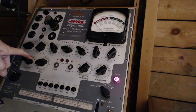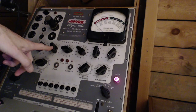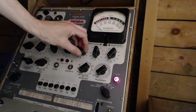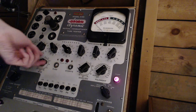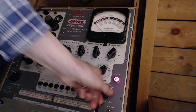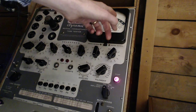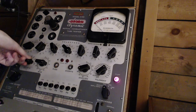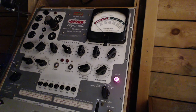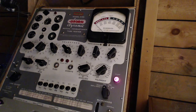The actual measurement setting for the 12SA7 is 5-4-0-6-7, with readings at 30 and 81. This tube should read almost 1900, almost 2000 - it should be reading up in the good zone. It reads good - no shorts, very good. So that one is good. Maybe that front-end 12SK7 tube is really the cause of the bad performance here.